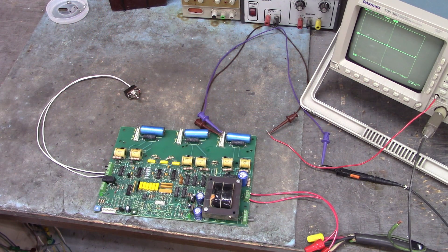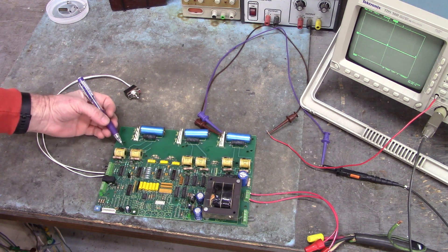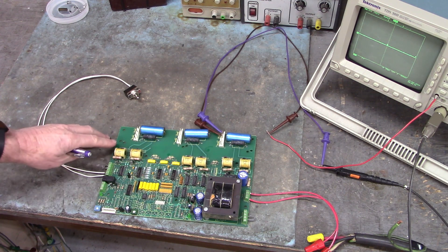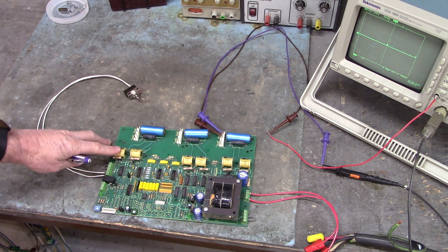Good morning. Here's the control board from a Motortronics soft start, model number LS2-48150-N. I don't have it installed on the SCR heat sink assemblies — this board needed some repair. Over here on the pulse transformer, we had two shorted 1N4007 diodes. They shorted because the SCR failed and shot back up into the gate cathode firing channel. I removed both diodes, tested the pulse transformer, and removed that as well.